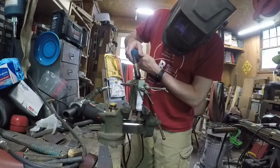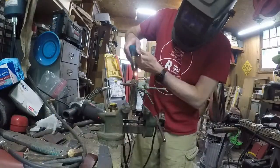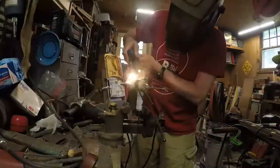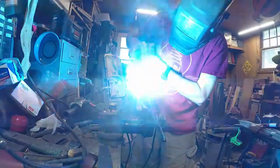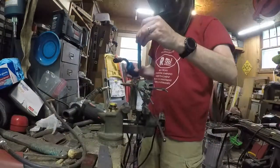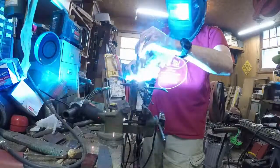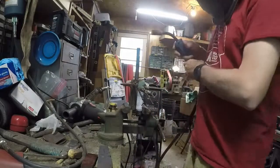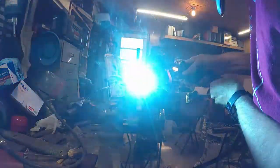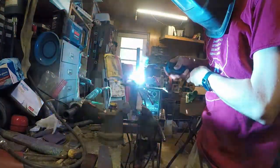The really good old-timers do this with just wire — they don't mess with MIG welding. The wire doesn't tend to stick in the weld and falls off. I'm not good enough at forge welding to do that; I like the peace of mind of having the parts tack welded together. Here I'm just welding on a handle — a little piece of half-inch hot roll steel. I'll put a pretty good bead of weld around the end because you don't want the handle falling off in the middle of the process. Again, all of this welding is just a contaminant that's going to have to get ground off later.